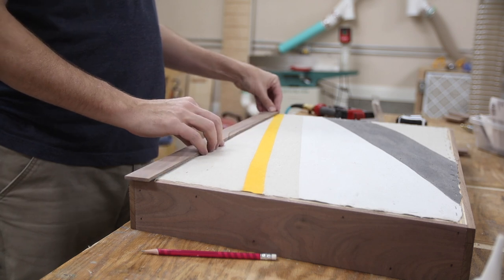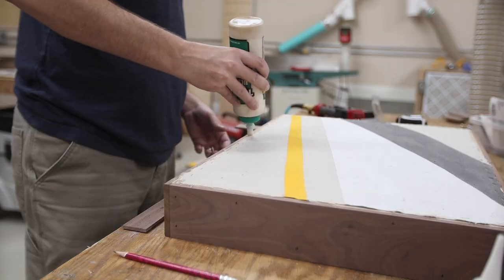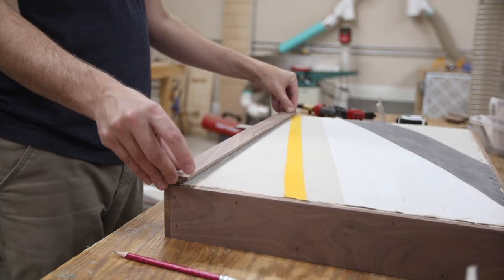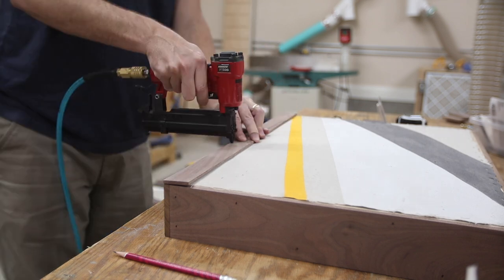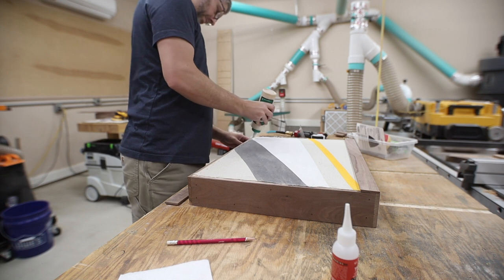Because of how full I stuffed these with insulation, there was a slight pillowing effect. Because of that, I did not want to go with miters on this finished frame with these strips because I was afraid that they would not meet up perfectly. And if you don't get a perfect miter on the corners, it really shows. So again, I'm going with butt joints here and I'll show you later that it was definitely the right choice